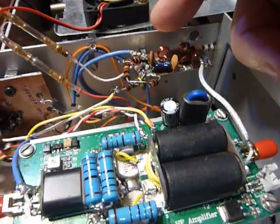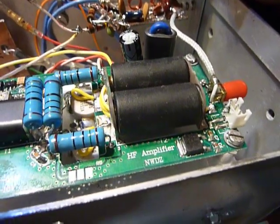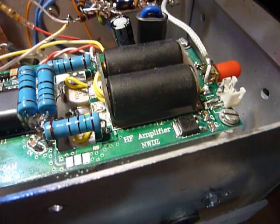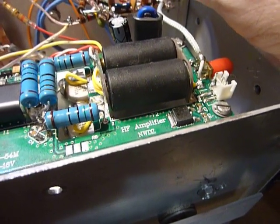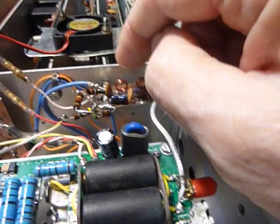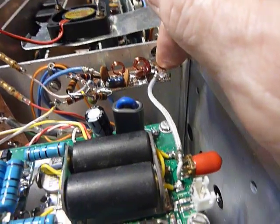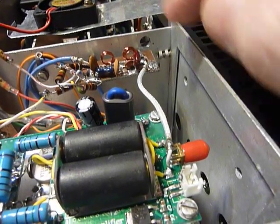This is a low-pass filter — one section is tuned to 100 megahertz, the other section to 150 megahertz. It's a simple little bandpass filter circuit I found on the internet while looking at the assembly instructions for the Packer six meter amplifier — they have a really neat little six meter amplifier. I took a little piece of circuit board, used my little grinder with a burr on it, made myself a small circuit board, and put that circuit on it just exactly as they have it. It actually develops a little more output with that in the circuit, providing a better match.